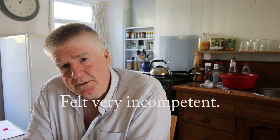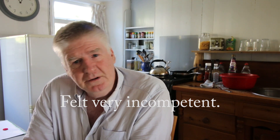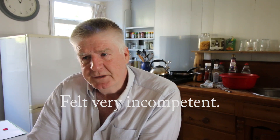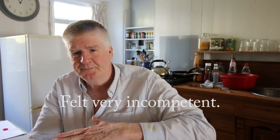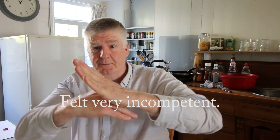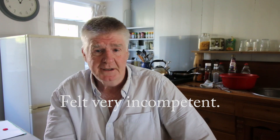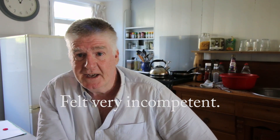But the second problem is a really major one. The luff length of the sail is too long for the mast, in that when the gaff is fully hoisted it comes up and it's jammed up against the shrouds. It means the gaff can't rotate — it'll just try and tear the shrouds off. So that seems like a major error.